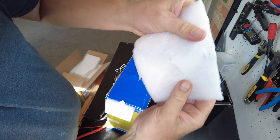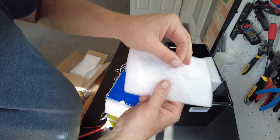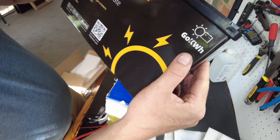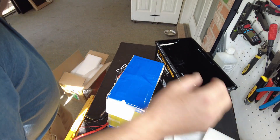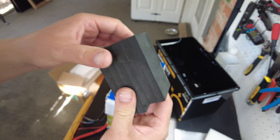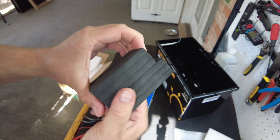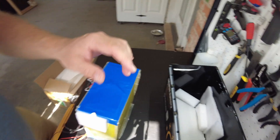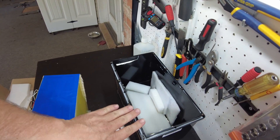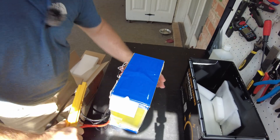This is just smashed down — that's not going to last. This piece right above the BMS is just kind of trashed from vibrating through shipping. Go Kilowatt Hour, you guys need to upgrade this foam to something better. You need to be using the high-density foam that we see in almost all quality battery builds — it's very strong and holds up.